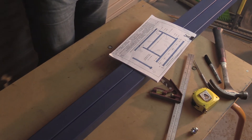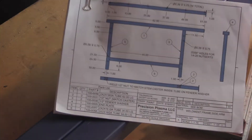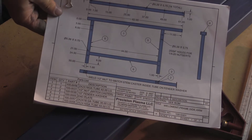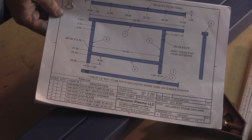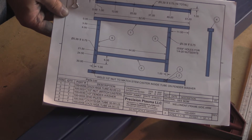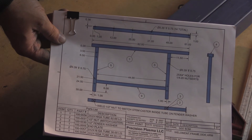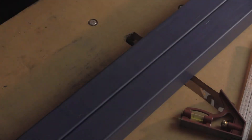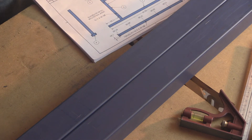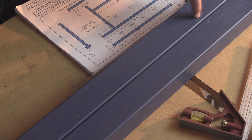Okay, let's zoom in a bit so you guys can see. The marks are pretty much done — I've come in 1 inch, 13, 25, 37, 49, 61 inches, and I've come in 0.38 of an inch, which is about 9.5mm. I'm not sure if the camera's going to pick these up, but they're all marked and punched. So I'm going to jump over to the mill and drill these holes. These particular holes I'm going to have to do a touch over size to drop the countersinks in.